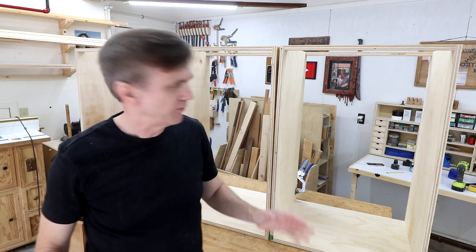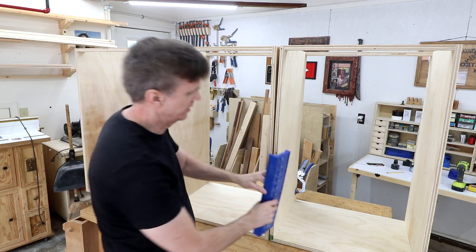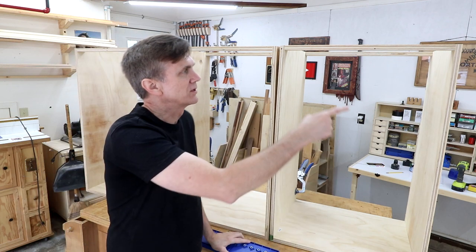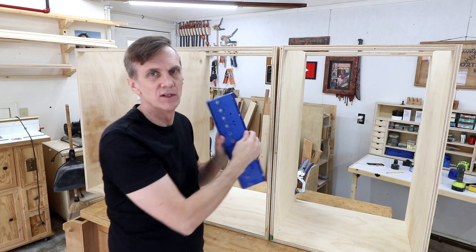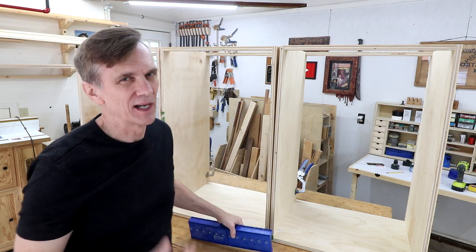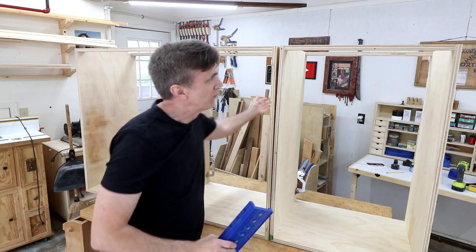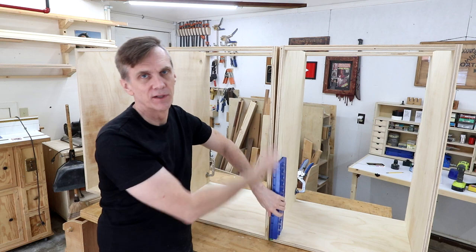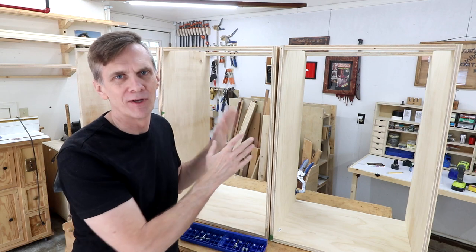I've got a couple of things to consider. First I want to put in some shelf pin holes, and I've got a jig that sits in there to make drilling those holes easy. But I also want to paint the inside first and then drill the holes, because painting over the holes kind of fills them up with paint and I'd rather avoid that. Plus I want to drill the holes before I put the backs in place, because the jig needs to grab along the edge to stay straight. So I've got a certain order I want to work in here — I'll give this a little more thought and leave it off for today.